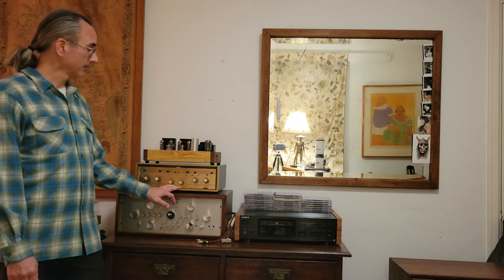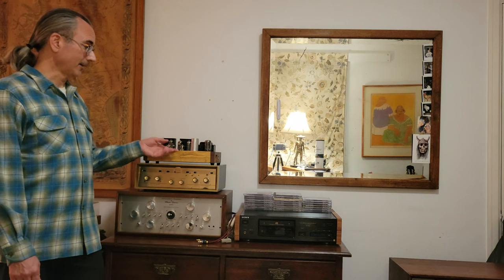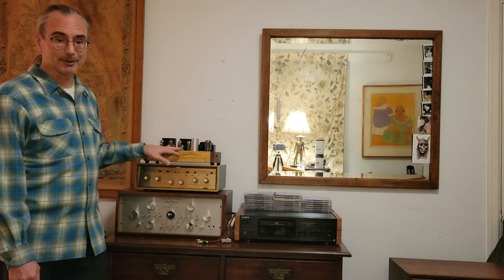Now, I don't know if I might do some kind of enhanced fixed bias. I could probably get some more power out of it. But I could also get more power out of the Beaver Valley if I did an enhanced fixed bias there as well. And if you're not familiar with enhanced fixed bias, that's a trademark of Dave Gillespie, the tube guru par excellence of Audiokarma.